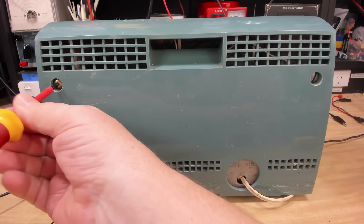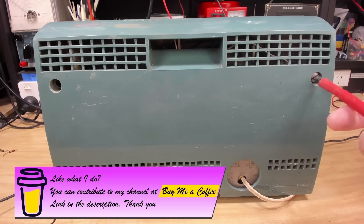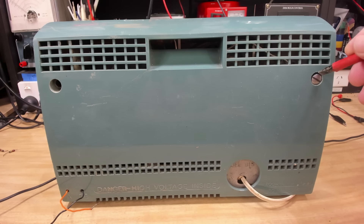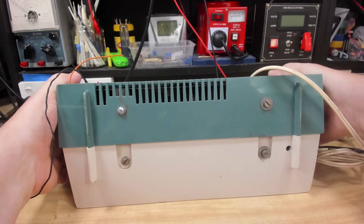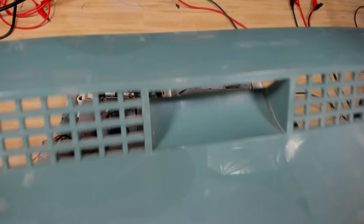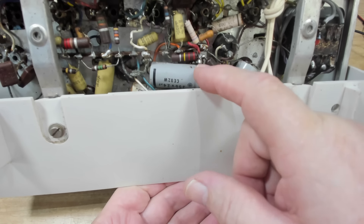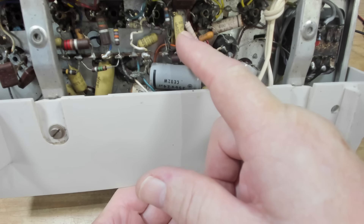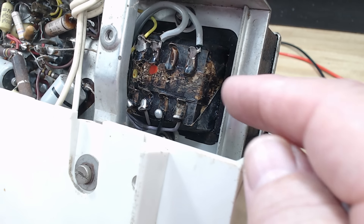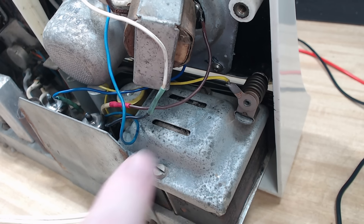There's two screws on the back to remove - one seems to be a Phillips, so somebody's changed that at some point. This is a valve set; they did make a transistor version later on that used the same case but went to transistors, so this model probably ran for around 10 years. I have an idea there's screws on the bottom as well - yeah, there are two. Immediately I can see it's still got the old filter capacitors; it's got the Phillips green caps in there. The transformer looks okay but it's pretty discolored, and it's got a little cover on it so I can't really see what's going on in there.